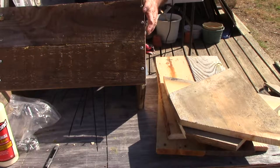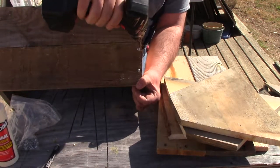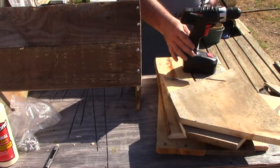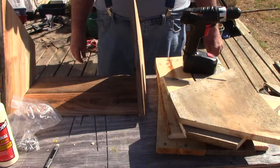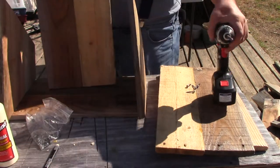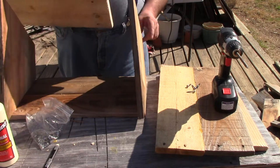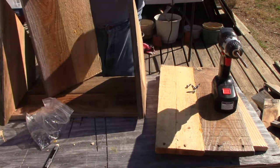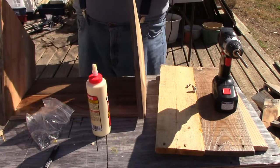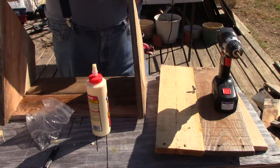Get this top one in, and then we will line up for the bottom one and put it in. We'll do the middle two. First side is on. The second side will go on a lot easier since I now have a stand to put it on. I'm lining this board up with the bottom of the box — we have the top section. I just drilled two pilot holes. Since I've got this up at an angle now that I can work, I can come in with glue and run two pilot screws in, then come back and drill the pilot holes for the second set.